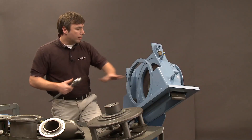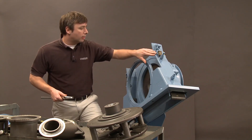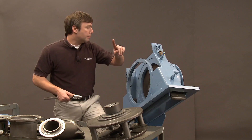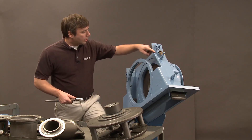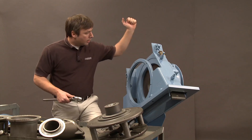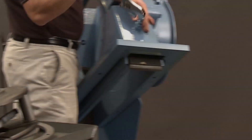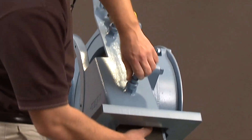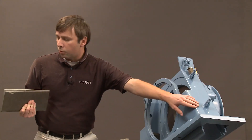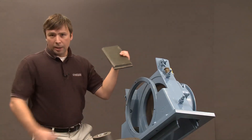The in-liners, with the cast housing, you're going to have a five-piece liner set — four in-liners, all the same part number, and one top liner. Wheelabrator added a straight section here so you can reach in and pull out the top liner without pinching your fingers. If you're identifying excessive wear, you can flip it up top and keep running.